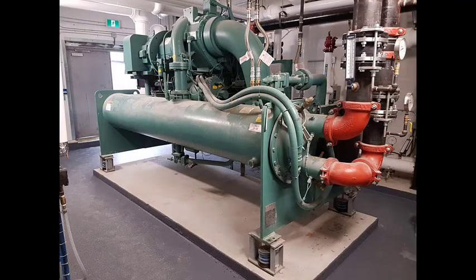So that wraps it up. My final conclusion on this site visit is that the isolators have been installed close enough to our installation requirements to be approved, with a caveat that should they experience any vibration or noise problems in the spaces below the chiller, they should adjust the working clearance and ensure the hold-down nuts and washers are not touching the hold-down plates.